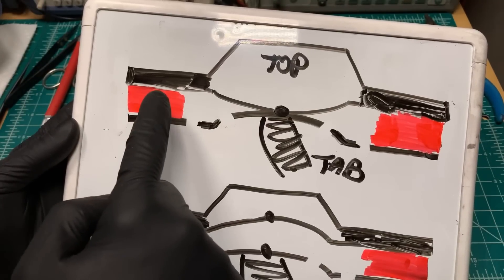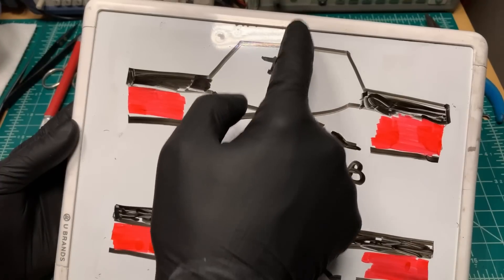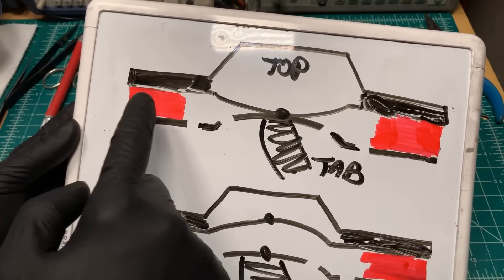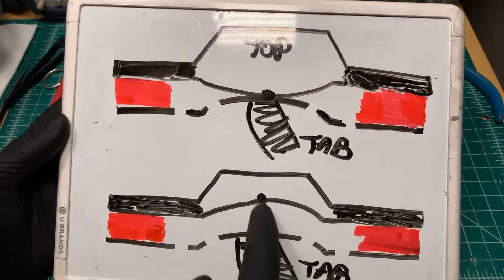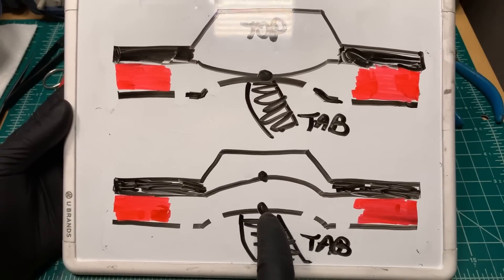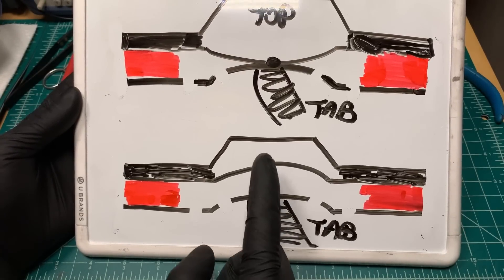There's an insulating washer here, so the current has to flow up through here, flow out here, and then out the top contact of the battery. It can't flow the other way because of the insulating washer. And what happens is if lots of pressure is generated, it comes up through these holes, and this disk actually pops up and disconnects the current, stopping current from flowing.